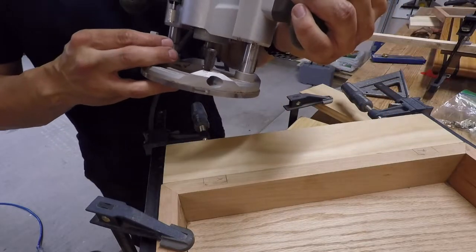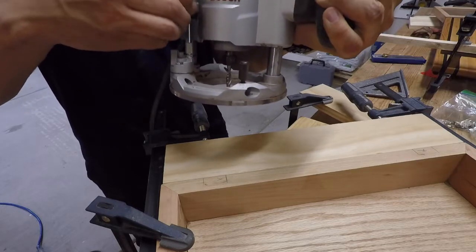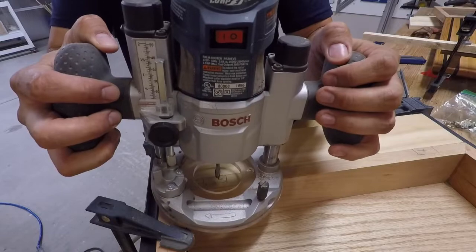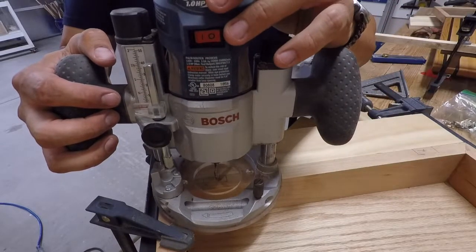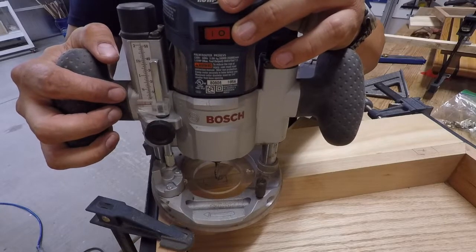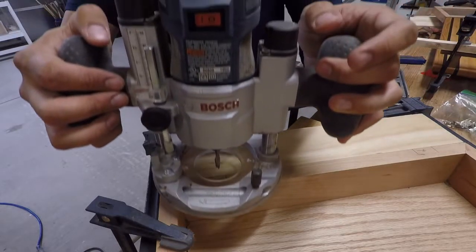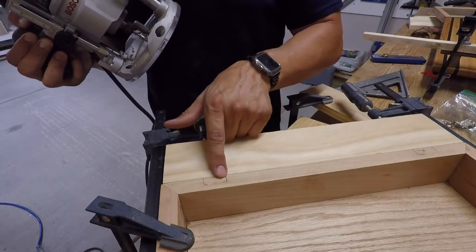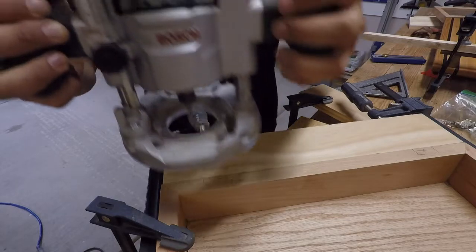Since I already have my router set, you can do a couple things - you can readjust your router so you know that if it pops up you'll have the same exact spot when you need to readjust it. What I'm going to do is lay my router down on its side and let it press itself into the wood so I don't have to make any readjustments. The speed on your router is not that big of a deal; you just don't want it blowing out any wood. I set mine to about two and a half to three - I'm using a Bosch Colt. We're going to cut short of the lines; we're not going to cut all the way to the lines. We're just going to cut close enough for the chisel to do the rest of the work, and I will be gouging out a portion of the scrap wood we placed here.